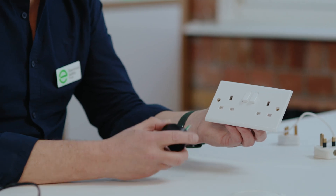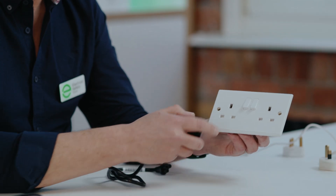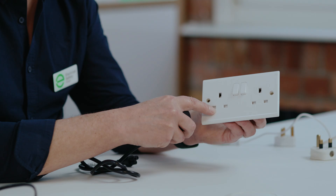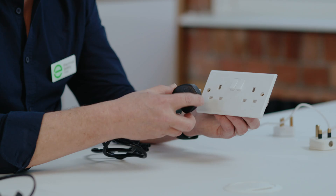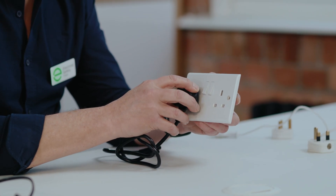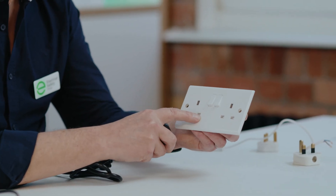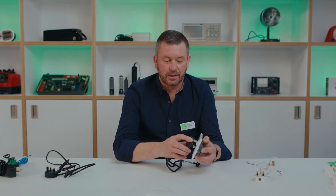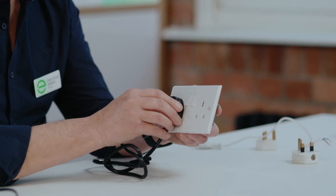The reason that the UK plug and socket system is considered to be one of the safest in the world is that the socket outlet has openings that are shuttered where the live pins are inserted. The only way these shutters can be released is with the insertion of either the earth pin into the socket outlet, or the simultaneous insertion of the two live pins pushing against the shutter, or in some cases it requires all three pins to be inserted before the shutters will open up and allow the connection of the plug.